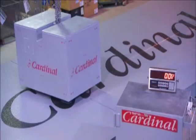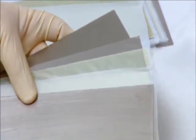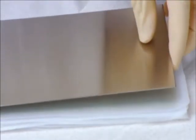The key to this enormous scale is a tiny component called a strain gauge, which sends signals to the scale's computer when compressed. They make the strain gauges from a laminate by bonding paper-thin sheets of nickel-iron foil, epoxy, and Teflon in a press.